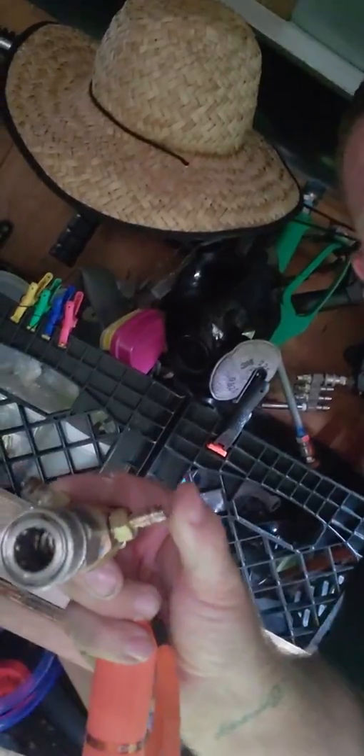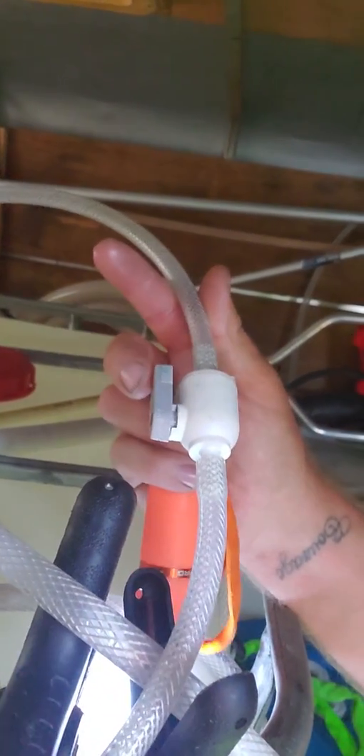I got a downstream tank but I think I'm going to get rid of it, because basically I set up one of those dual barb injectors. So I got one line going into my big bulk tank of bleach, and the other one I drop in my Snotmanade bucket. This way I can keep everything separate — I don't have to do any mixed tanks at all. One line can go to my bulk bleach, one line goes to my soap. And on my soap line I have one of these little ball valves so I can dial it in a little bit.